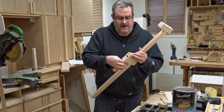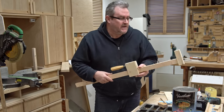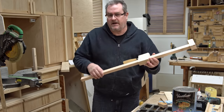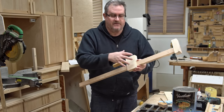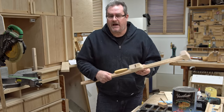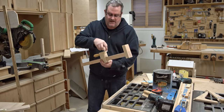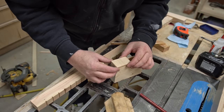I haven't tried it yet because I want the epoxy to dry a bit more, but it seems to operate properly and I have no doubt it will work — it's just a question of how much this bar will bend under load. This is softwood, and it would be best to use a nice straight-grain hardwood. I've got some ash for the bar, and for the rest I'm either going to use hard maple or cherry to make them look really nice. I also have one other thing to add: a pad that glues across the front with the grain oriented across, so any part sticking out past the side won't break off easily and it'll give a nice clamping surface.